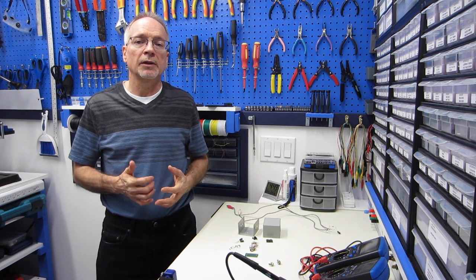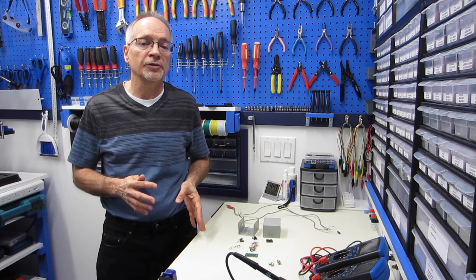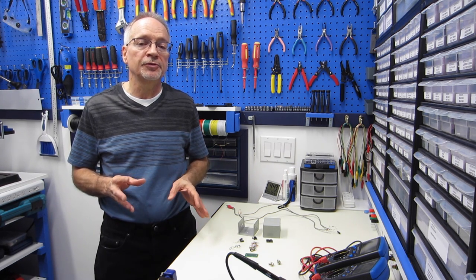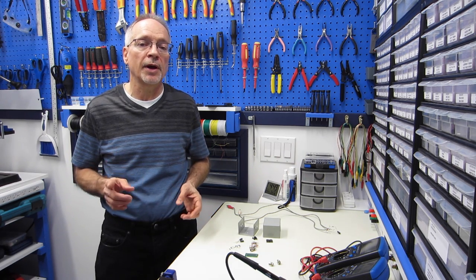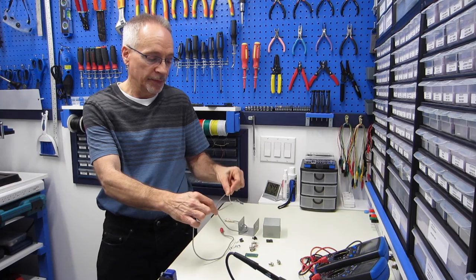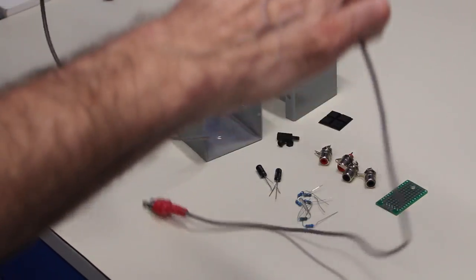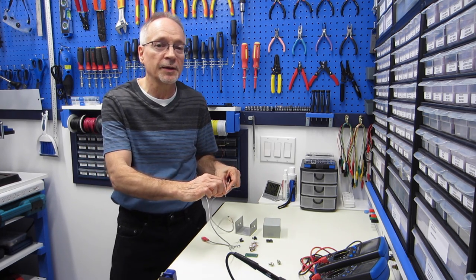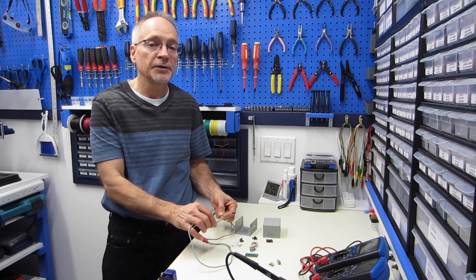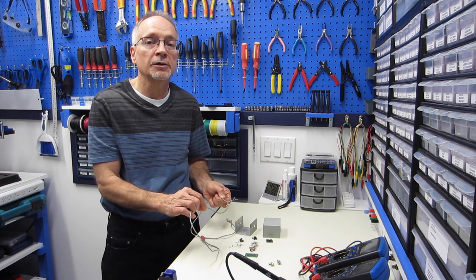When I was developing the line to microphone adapter I needed a way of prototyping it. I found that a solderless breadboard wasn't a very good solution because it just picks up too much electrical noise for an audio circuit. So I spliced an RCA cable and hung my components free-form on the cable — pretty crude but it did work for developing the circuit and getting the component values fine-tuned. So having said that, let's take a look at the schematic.